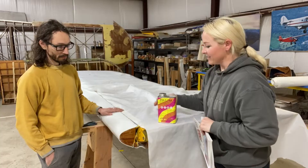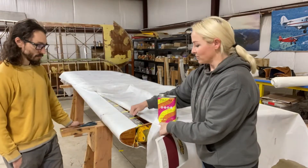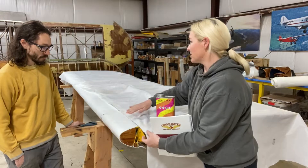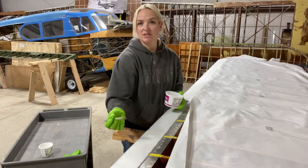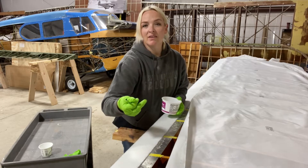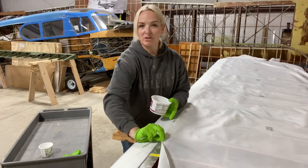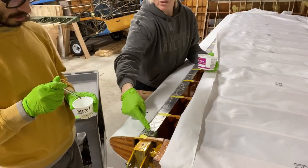We're using PolyTac, and with this two-inch gap made on the leading edge metal — a structural part — we're going to create the first seam of the fabric and glue down this first two-inch section all the way. It says to glue about 12 to 18 inches at a time since it dries pretty quickly. The trick is to put it down pretty heavy, then wait about 10 to 15 seconds so it gets tacky, but not much longer than that. Then put your fabric down and let the glue soak through, making sure it's completely saturated.